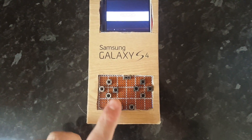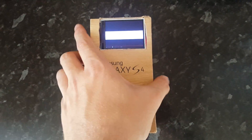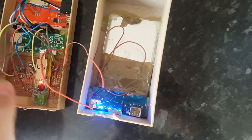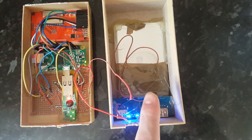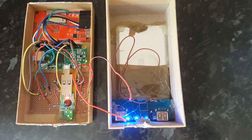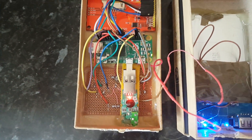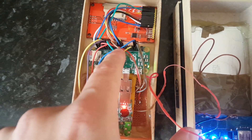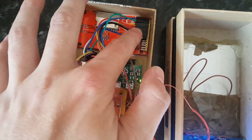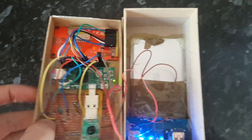So you've got your full up, down, left, right buttons here, select and start, ABXY and your power switch. So if we open it up, I think the battery I used was 10,000 milliamp, just a portable power bank that I sort of took apart and glued in place. We've got USB audio and then all of the buttons go to the Raspberry Pi Zero through the GPIO, and then the 2.4 inch LCD screen, again using the GPIO pins of the Raspberry Pi.